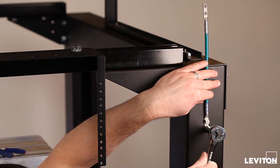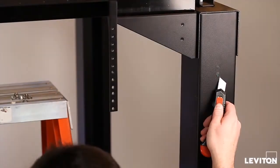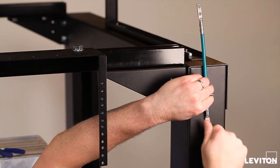The overhead infrastructure platform system is designed to accept industry-compliant two-hole compression connector grounding straps. Simply remove the protective tape and thread plugs, assemble, and mount the grounding connectors to the manufacturer's specifications.